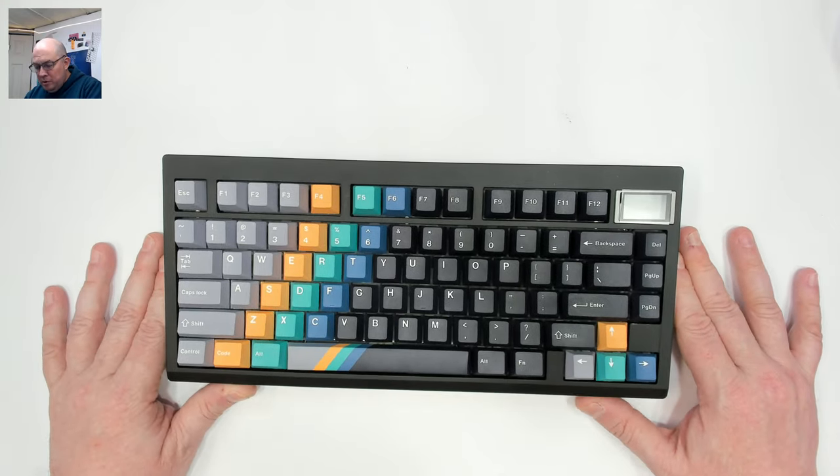All right, so I've gone ahead and punched out all the holes, so we shouldn't have any issues with switches, but we can go ahead and try and grab a 5-pin switch. If you don't have 5-pin switches, it won't be a trouble, but if you do, but you're still going to be using 3-pin switches, I just recommend for the first go, either loading up an entire set of 5-pins or just using a 5-pin switch to push it down and into the holes to make sure that you can do this. Now, having a plastic spudger or something that you can use to lift up on the plate is going to make the biggest difference to getting these in properly and actually actuating, because you can get it in, but it's halfway on the plate, so it's not actually all the way in and making contact below, and it might if you press on it really hard.